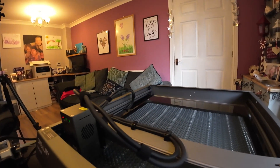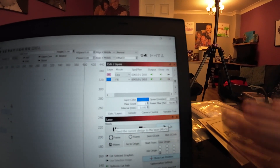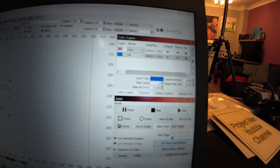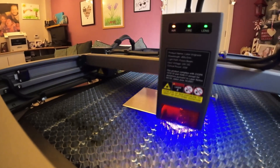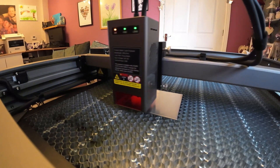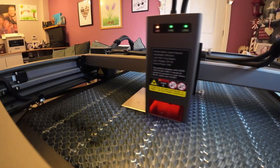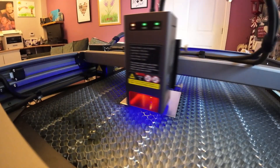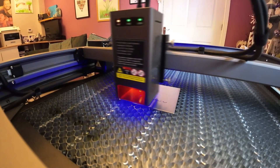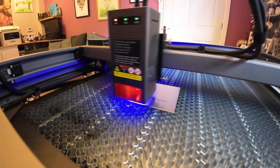I've framed it all up and we're just going to hit start. I've put it on speed 6,000 and power at 50% - I've still got to learn what powers I need to be using, so I'm just going halfway with the power. The air is on amber because we're not using air on this for engraving. I've got my glasses on. This one reckons it will take about five minutes, and the reason it's going a bit longer is because I've got the letters filled in rather than just the outline.